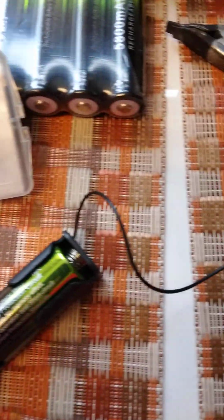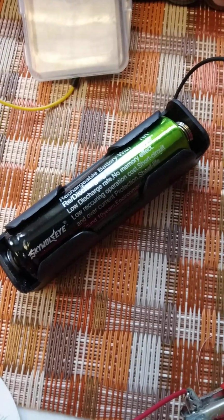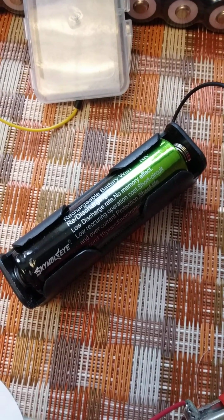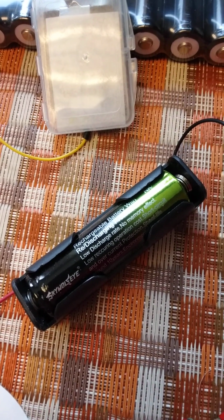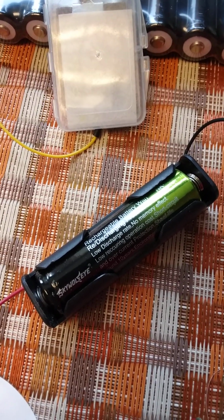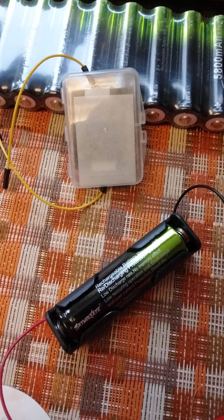In with a lithium ion 3.7 rechargeable cell, we can bring the graphite up to 4.1 volts, discharge it to 3.0 volts, 750 milliamp charge, 750 milliamp discharge with a minute rest period. So we ran 75 cycles. We were checking the mass balance before and after the run.